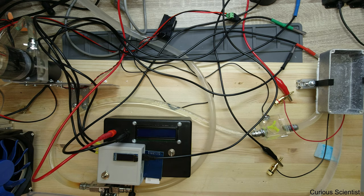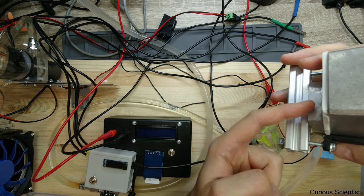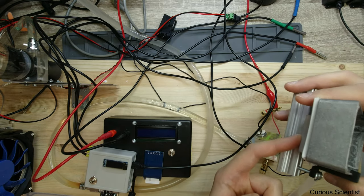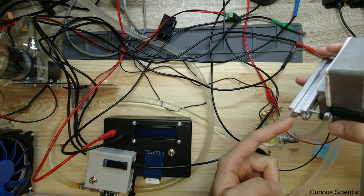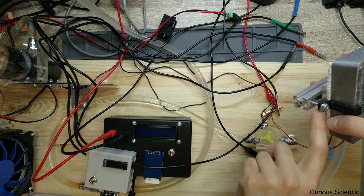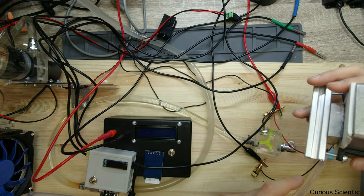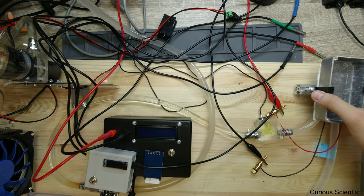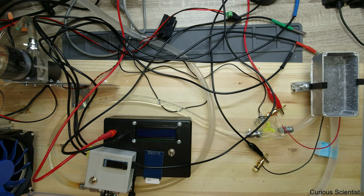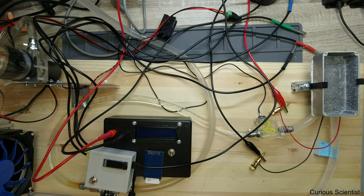What we have here is my regular water cooling system. Under this thing we have the aluminum cooling block. I will put a thermocouple inside here in that channel, so that will measure our hot side temperature. The Peltier cooler is in between this cooling block and the bottom of this tank or container, and we will run it through a power supply.